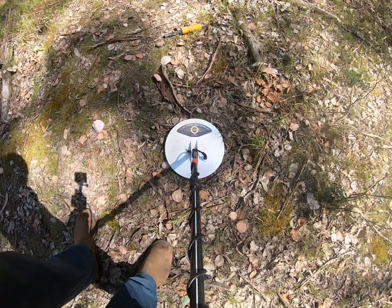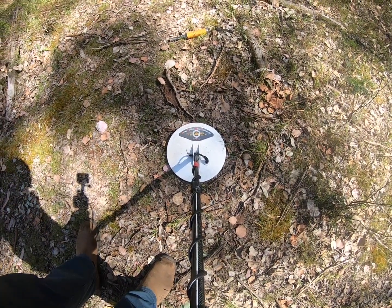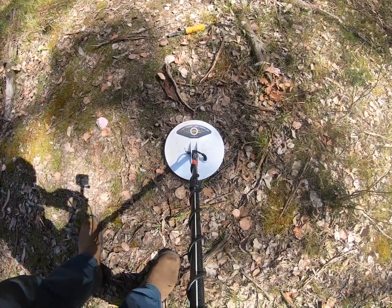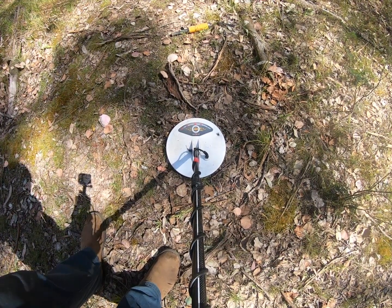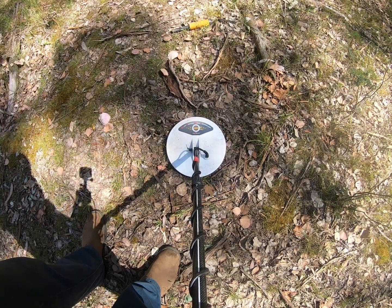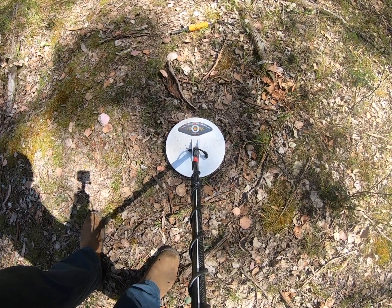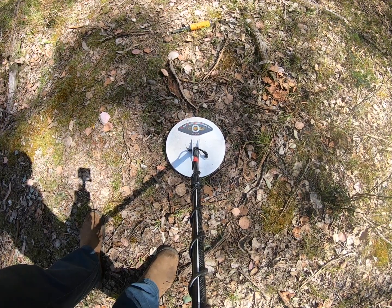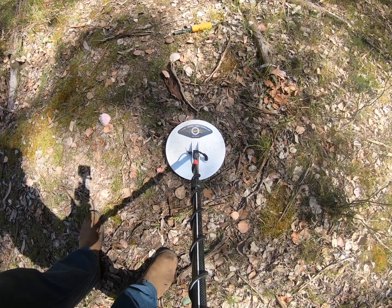For the ground balance, I don't use the auto ground balance — I just manually ground balance it. Preset is 150 and as you can see it's well out. I did have this turned on before, as I think Reg said on one of the forums just in the last few days, with the new ground balancing method your general ground balance is going to be somewhere in the 200 to 240 range. Here it's up at about 220, but let's just take it to 180 first.